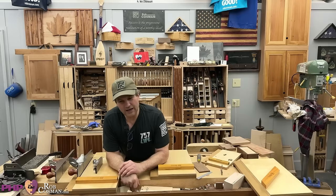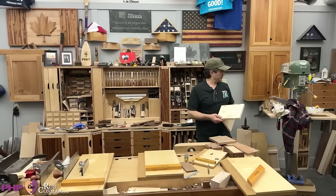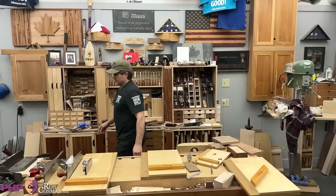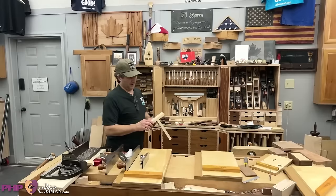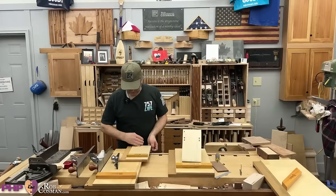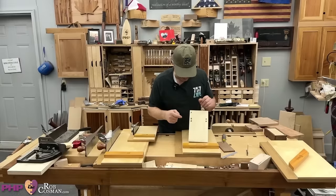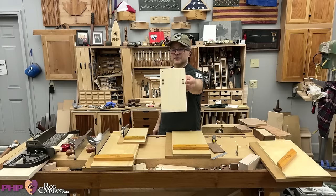Yeah. Well, I only use the block plane for really small parts, and the one that comes to mind most often is when we're doing this. This was a video that we released, and we didn't do it. Where's the one where I didn't... right here. I didn't glue it in. Where are you pointing? End of that bench. Yeah. So when I'm doing the wedges and I want them to fit just right, so I'm planing a little wee piece like that, I find it a little easier to do when you can take your block plane and go in there and plane that small piece so that it fits in there just right. Don't want it too wide because you'll notice it, because it'll push out beyond the edges of this rectangle. Don't be too small because it'll leave a gap. You want it to end up working just like that.